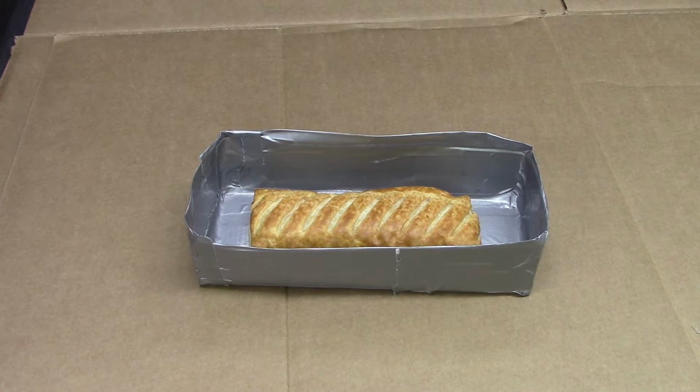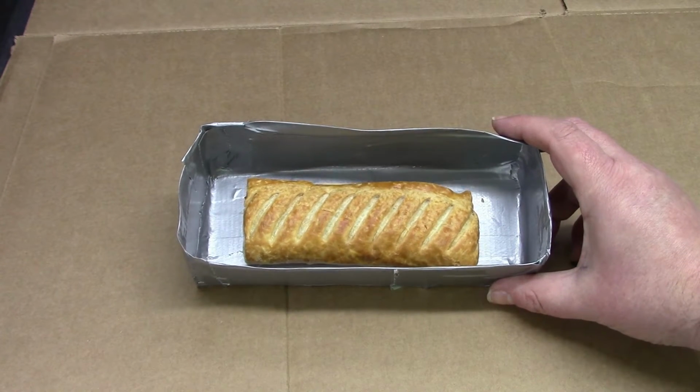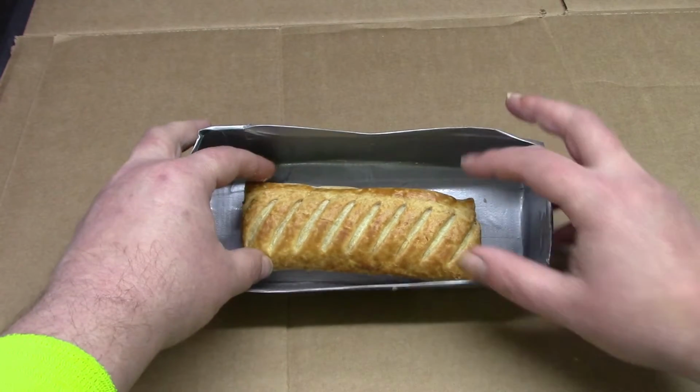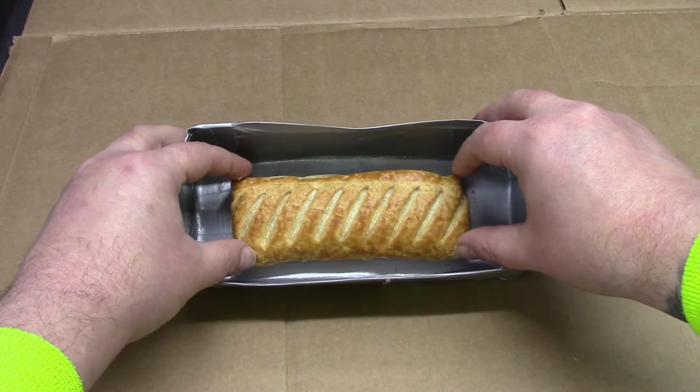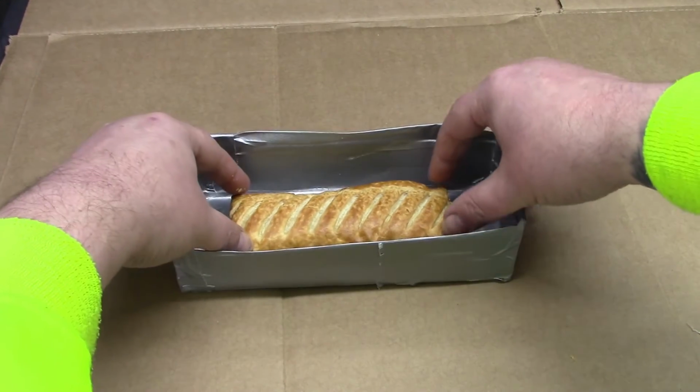The container should be at least half an inch to 1 inch bigger than the object we're moulding from, and also half an inch to 1 inch higher, and that will form good strong walls all the way around with the silicone.